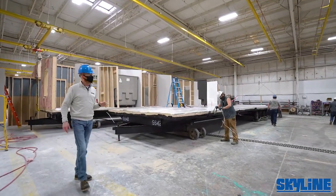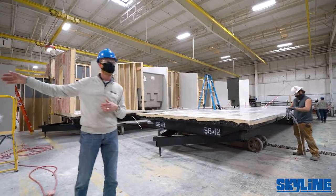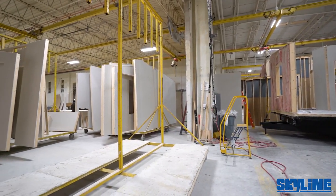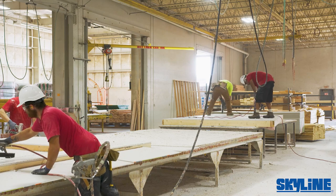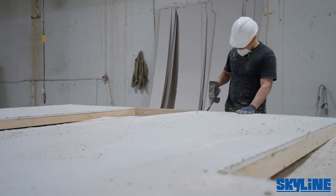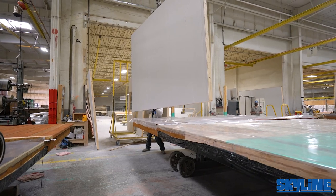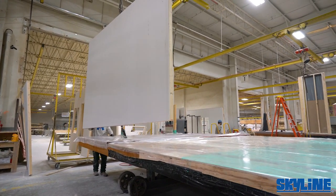As it rolls into the next phase, you'll see our first wall partitions area. There are different jigs for these guys to lay out the sheetrock and lumber, all working on a tabletop instead of up on a ladder in precarious positions outside. Once they get those stacked and racked, they put them in their bays. Cranes then grab walls and bring them out, placing them into position to make up the different rooms and configurations of the floor plan.